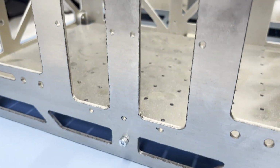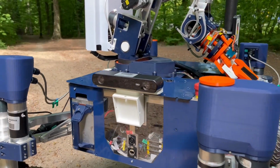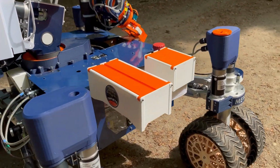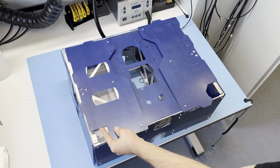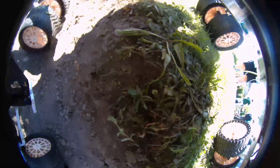It also has newly developed mechanical and electrical interfaces. This lets us use the same main body for future rovers, whatever the needed tools. The outer secondary structure is made from painted acrylic glass to protect the internal components. Attached to the bottom of the main body is the hazard camera to help the operator notice potential obstacles.